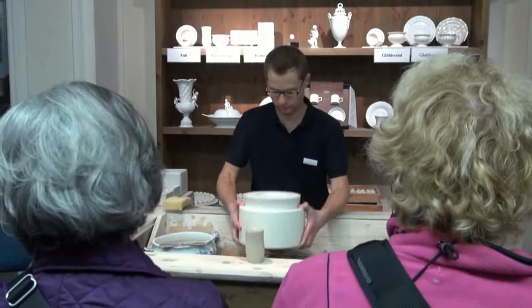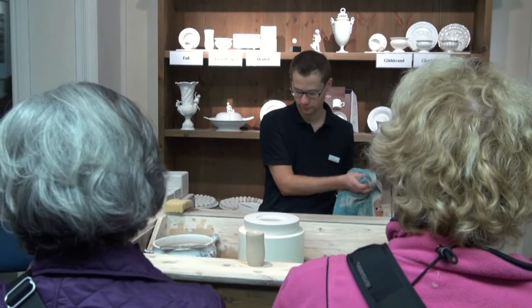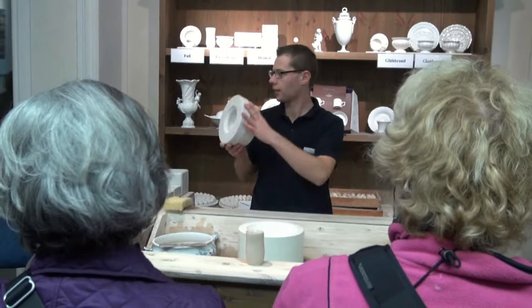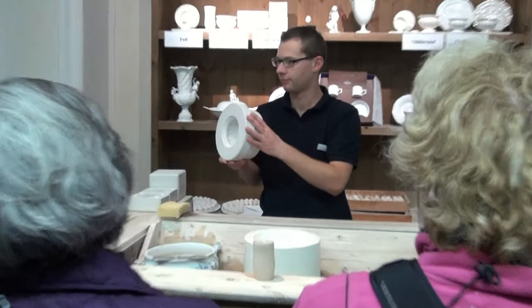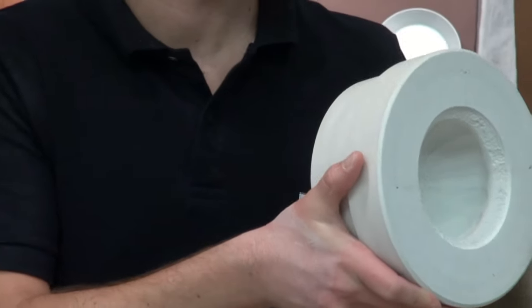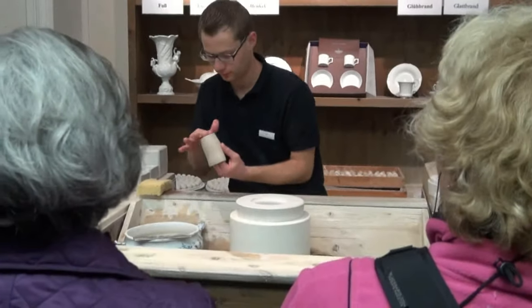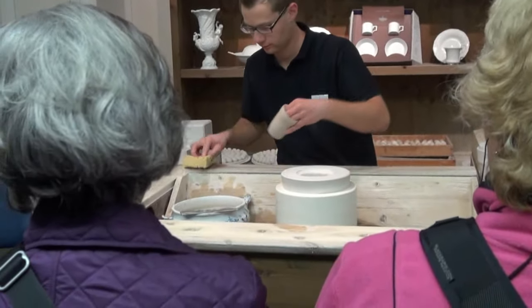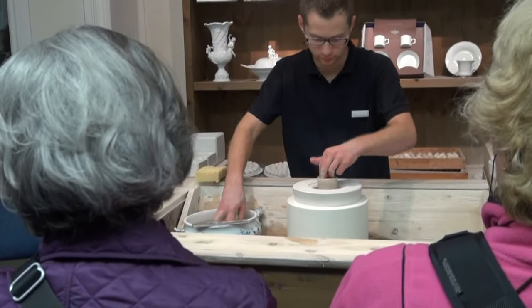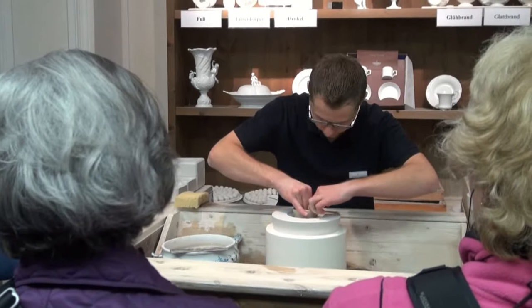Porcelain tableware is generally made by molding. Here, for example, we have a five-piece mold bearing the impressions of the relief pattern that is to appear on the outside of the cup. By means of a wet sponge, the porcelain body is being carefully pressed against the mold from the bottom to the top. Excess paste from inside the cup is being removed with a template to reach the desired thickness of the walls.